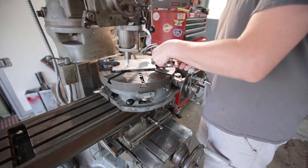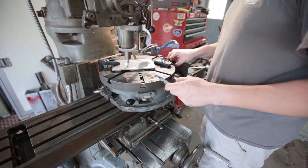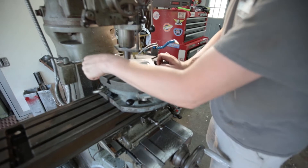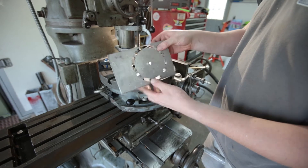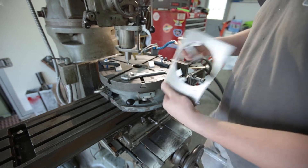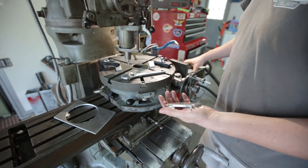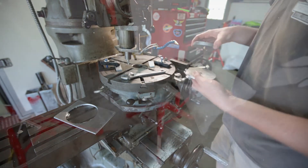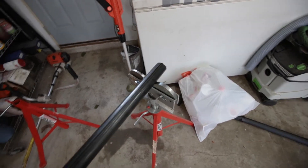All right, so here's the thing about doing this on a manual mill — it takes forever, but you can do stuff like this. I now have a nice perfectly round roller. As I went around I left — I forget, I think these are called like footprints or something like that. I should be able to pop it right out of there. Now I can just clean this guy up, and I have — I know it's an aluminum version — but I have an analog to that guy to use in that stand. I now have a fully functional rolling pipe stand!